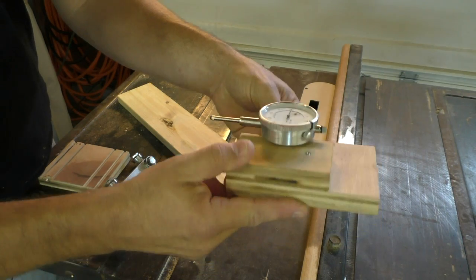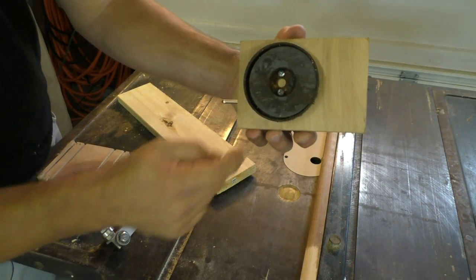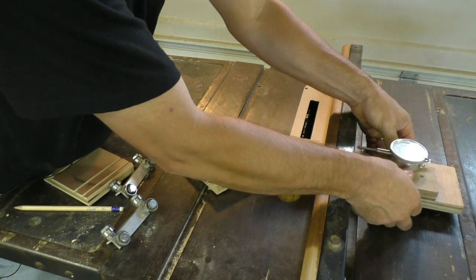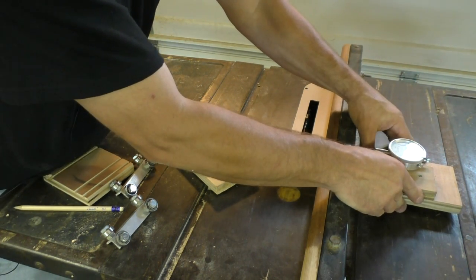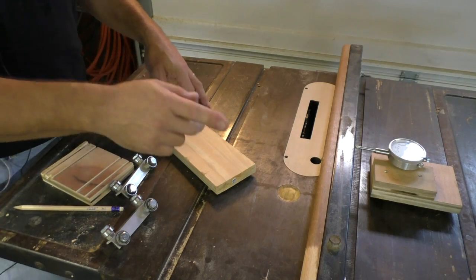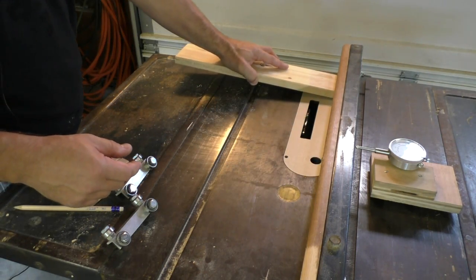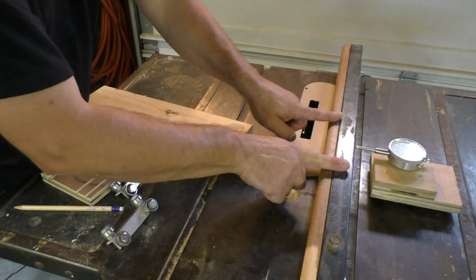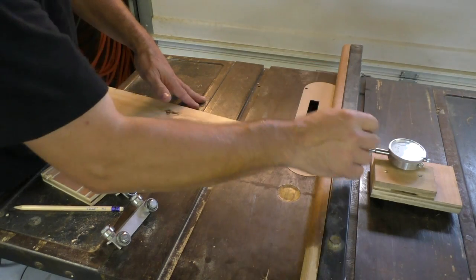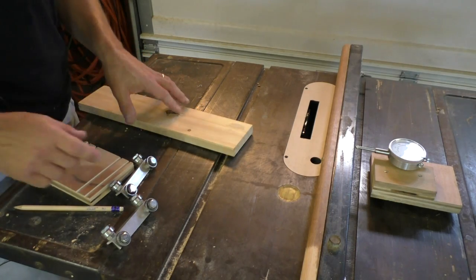The answer is this right here — this is a dial indicator. I've got it mounted on two little pieces of plywood and there's a magnet on the bottom. I got this off a CB antenna from a yard sale a long time ago. What I do is put this on here and zero it out, and once you've got it zeroed out you can go through here. This dial indicator will go up to a thousandth of an inch — it's very accurate, and this is a very accurate way of making this cut.